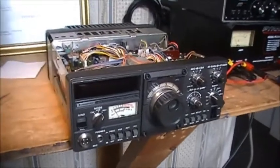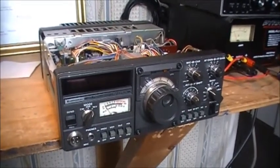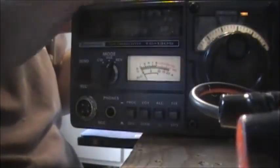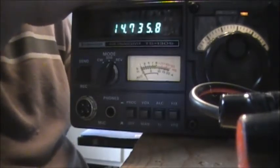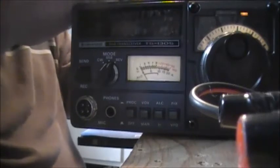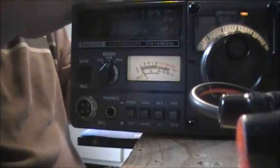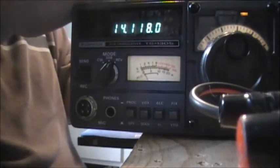If you're interested in seeing the repair of a TS-130S, stand by — I will be right back. So I got the board up and I'm pressing down on that transformer again. There's definitely a broken trace here somewhere. I push back up on the board from the bottom — nothing. It's only when I'm pressing down. Pressing down — display on. Pressing up — display off.